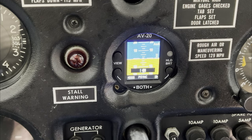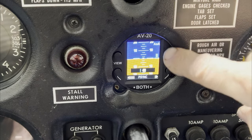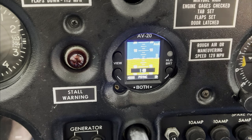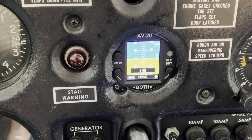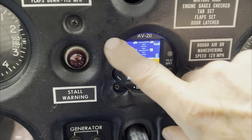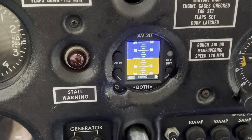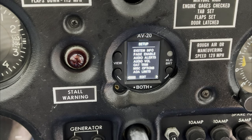This is probably my single favorite feature — a backup to the attitude indicator and slip/skid indicator. It also has an angle of attack indicator in the upper right-hand side. The cool thing is, if you reach critical angle of attack depending on your settings, the screen will switch to angle of attack, start flashing red, and send an audio alert. Continuing, you can get rid of the angle of attack and the slip/skid indicator by pressing that button, leaving you with purely an attitude indicator. There are display options depending on which page you select.